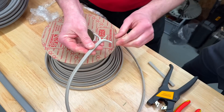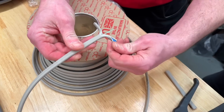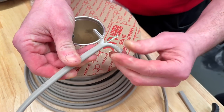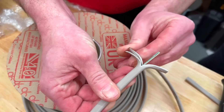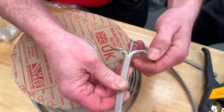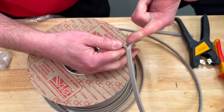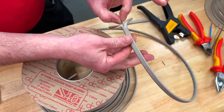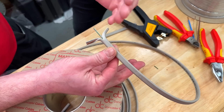It is, because we've got now a completely different compound. We've shrunk the sizes down, so we had to increase the mechanical properties of the compound so that it still gives the same amount of protection. It's EarthTech compound on there, not normal twin and earth compound. So there's a subtle difference when stripping it. If you're thinking this is really tough — the reason I didn't like to pull the protective conductor in this style of cable was it was the smallest conductor in there, and you're stressing it the most.